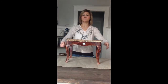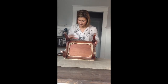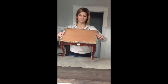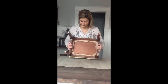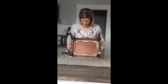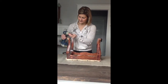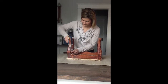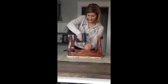The first thing you're going to want to do is take your piece and flip it upside down so that you can see how it's all put together. On this one, the fabric is being sandwiched in between the legs and there is a top board that gives the support. If you flip it over, nine times out of ten you're going to find some screws going through the bottom — whether it's a stool or a chair, you almost always have screws attaching your base piece to the legs. Go ahead and take those out, and make sure you save all your screws so when you put it back together they're all the right size.